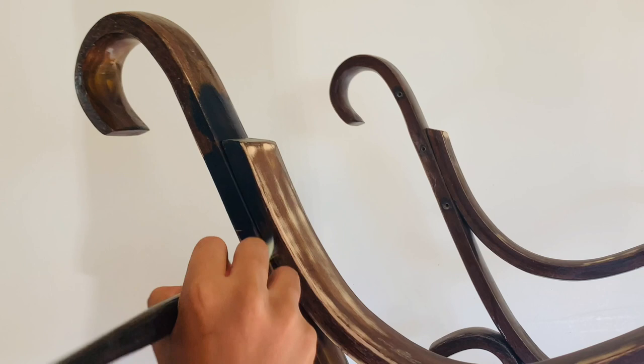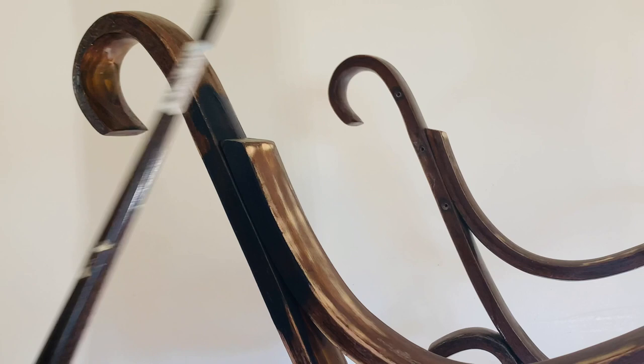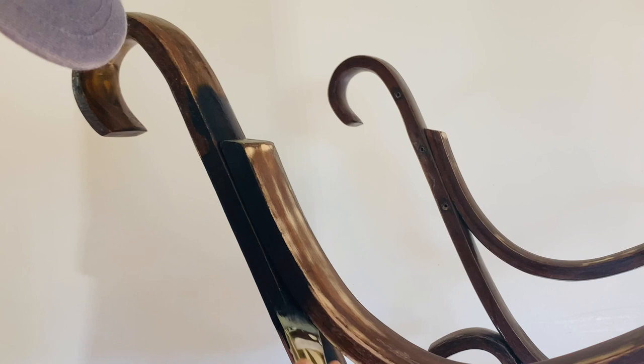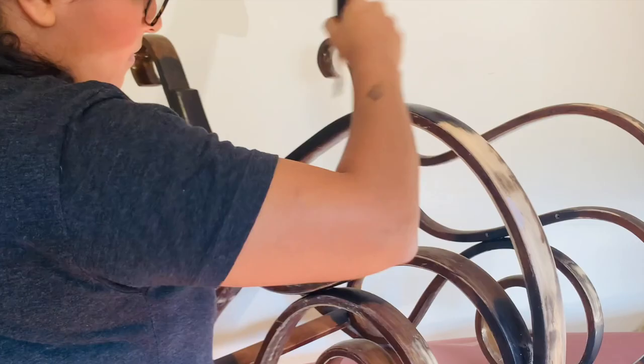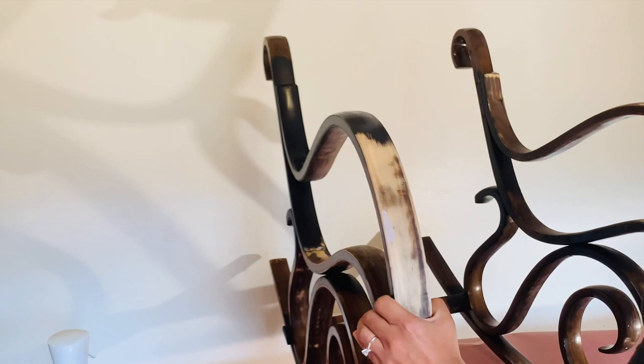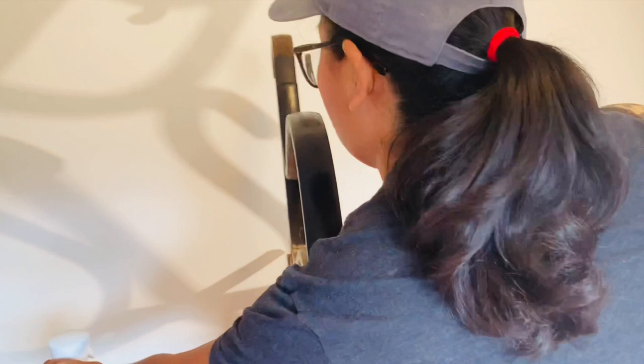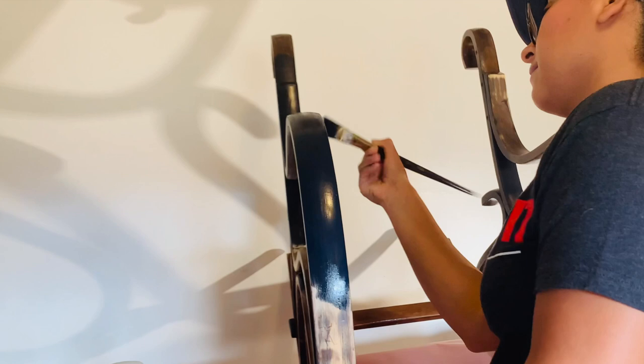I bought this paint from my local retailer and they clearly stated that they did not like the formulation for this paint. Before using this product, I went on Dixie Belle's website and I read their instructions. One of the things that stood out to me is that they do not recommend to add water or to water down the paint unless you are using a sprayer. In my case, I wanted to try both. So the first coat on my chair I did with a brush, and the second coat I actually sprayed. It's not on video, but you guys have seen me spray other pieces. Based on my experience, I do not recommend this paint for dry brushing or blending unless you're a blending goddess like Kacha or Brandy. It's just not something that would work out for me.